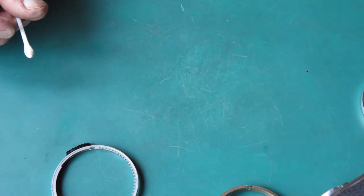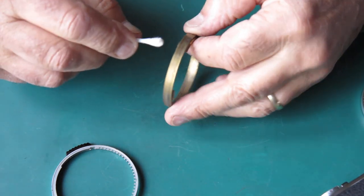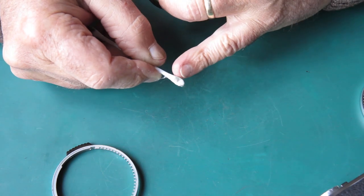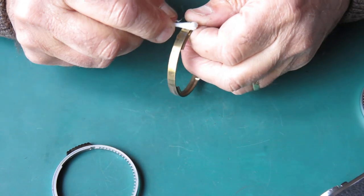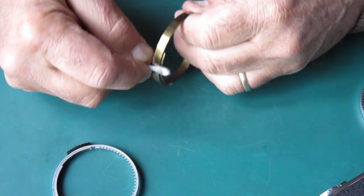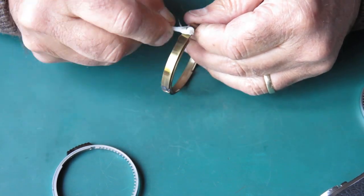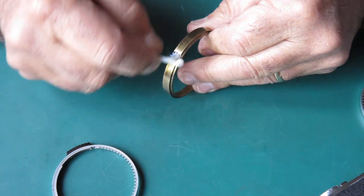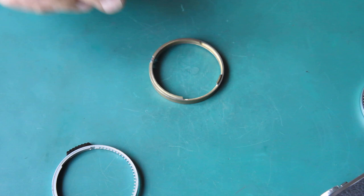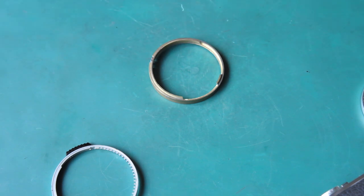This brass ring is often quite sticky. Some of this is corrosion, I would think — you can tell by the color; it's not quite natural looking. Sometimes if there's been any moisture in here, you actually see discoloration from corrosion, and that's best polished away with a brass polish or something similar.